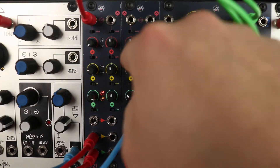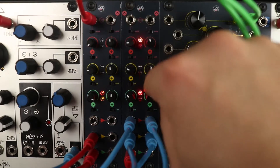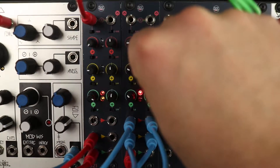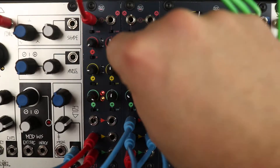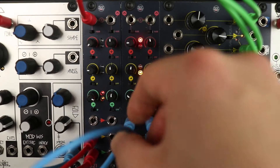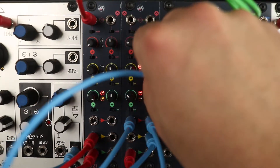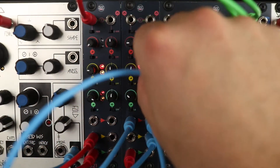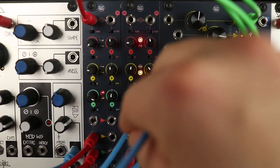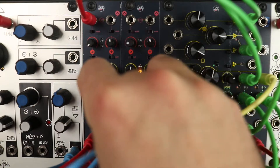In case it's needed, you can also offset any control voltage. While if no signals are connected to a section, the offset may act as a control voltage source. Or you can also combine up to three signals together, so it may act as a CV mixer.